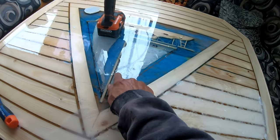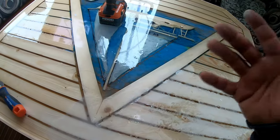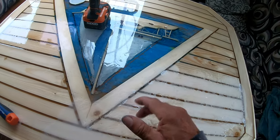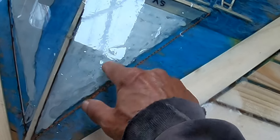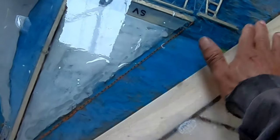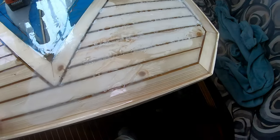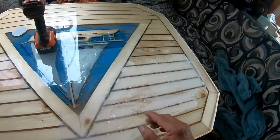Where I got a mess — I mean that's not the extent of it, but these I can deal with. I could deal with filling this, I could deal with leveling this off and getting rid of this ripple. But all of this is related to the fact that I did the pour and I could not eliminate the air. When I got here with the heat gun to eliminate this bubble, it was already gelling up so it created a wave effect. I wish that was the extent of the trouble. The big problem became when I got to this side and I had all this bubbled up in white. Not everything I do works in my favor. I've got a hell of a lot of work ahead of me to fix this, and I will let you know — I'll probably record what I do from this point on to fix this issue. See you in a bit.